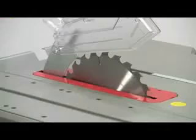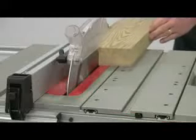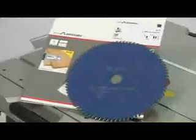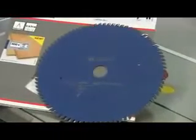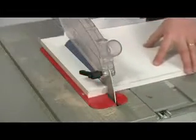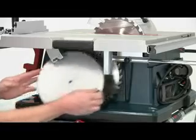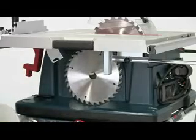The blade diameter is 254 mm and the one supplied with the saw has 24 teeth, making it ideal for ripping and general purpose cuts. For finer work there's a good range of other blades available to suit a variety of materials. For instance, the 72 tooth blade will produce clean cuts on laminate and veneered boards. A useful storage box is attached to the base under the table so you can always keep your spare blades handy.